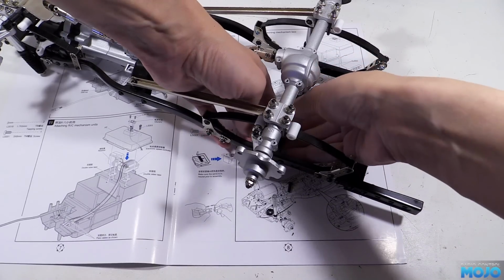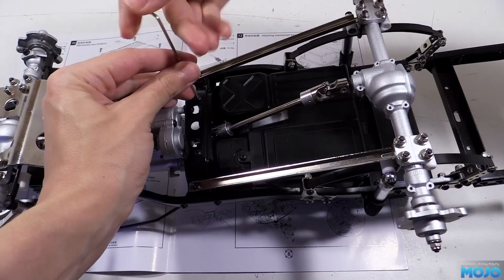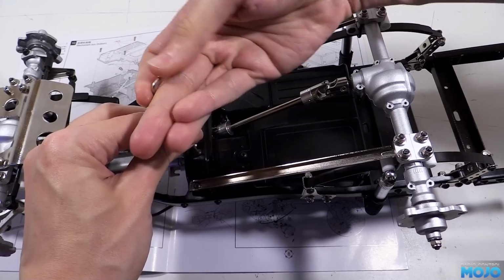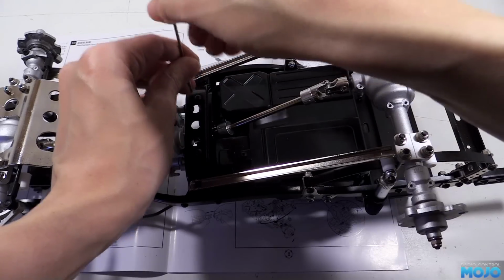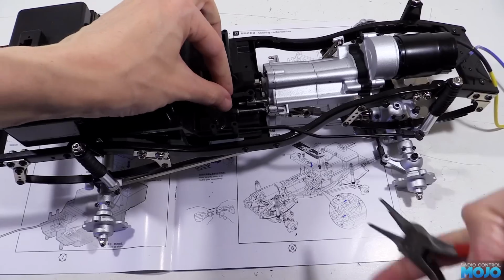It's also worth mentioning, because of the O-rings, you can't fully tighten the screws. They need to be loose enough that we don't squash the O-rings too much. That also means we don't want to go and tap the posts. Having the screws make their own threads will allow them to grip and not fall out when they're only partially done up. The last job for step 12 is to clip the ball ends into the balls.